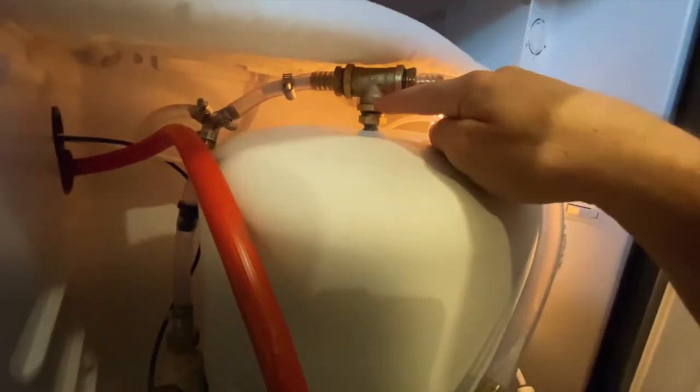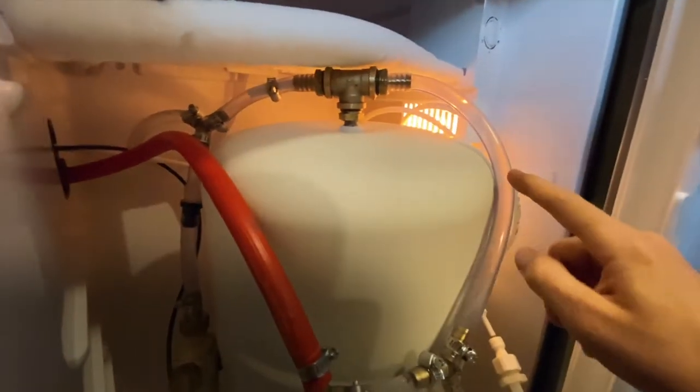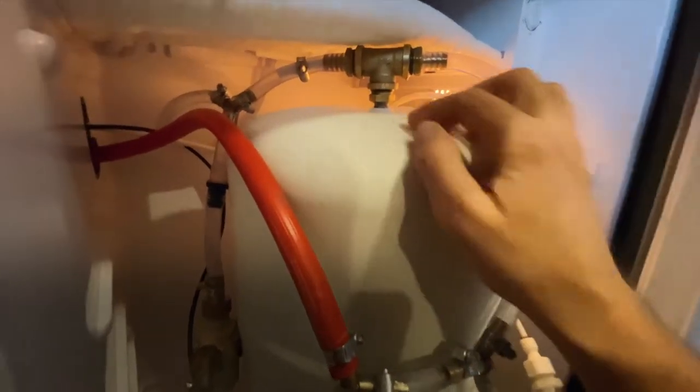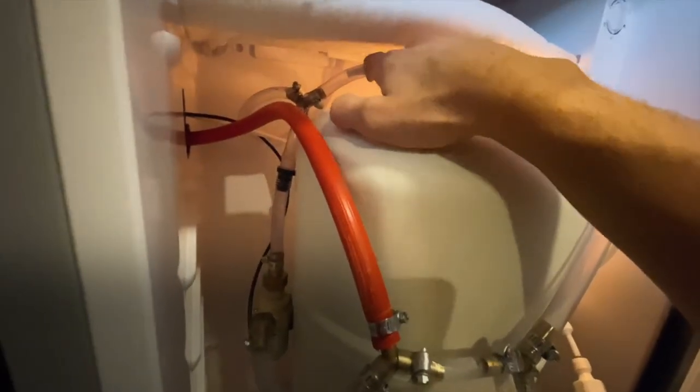There's a white tube inside of this clear tube. That white tube is thinner and smaller — it can fit through the fittings without blocking them, and then it goes down all the way to the bottom as a dipstick. So water would flow up that white tube and out this side. At the same time, water can flow in this side and around that tube, and it drops in on the top. That's the genius — look up on YouTube how to do that.